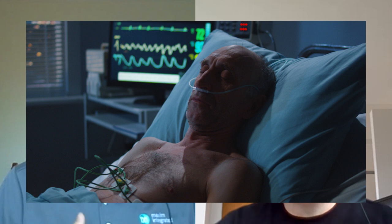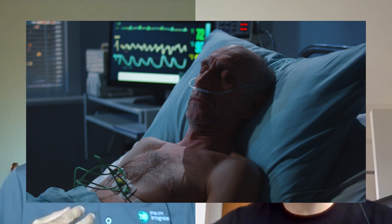Sure. In the medical field, one neat thing is it's been used to measure somebody's breathing up and down. That's done by connecting to a patient monitor — the DS28E18 is connected to an I2C accelerometer that's on someone's chest. The accelerometer can detect the chest going up and down, and that's relayed back to the patient monitor. Just a great little application.